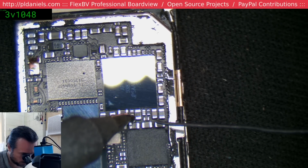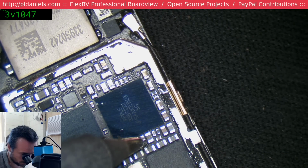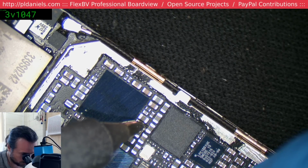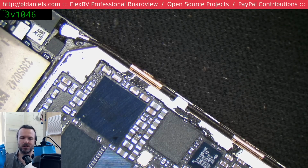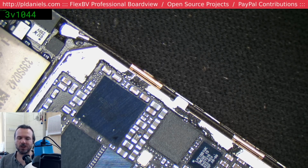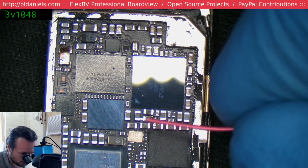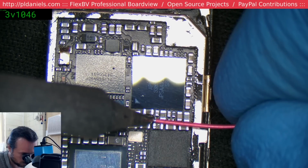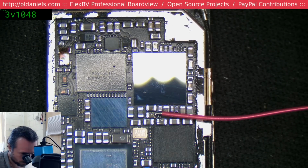So now you're saying there was no backlight on it, and I'm pretty sure what it actually is, the lack of the 5V7 line we have here means that the LCD, with LCDs you have to constantly flip the polarity of the actual driving member. I forget which part of the LCD it is, but you have to basically drive it up and down, positive, negative, positive, negative. Otherwise it will just start fading to black as all the elements get stuck in an overdrive situation. And the 5V7 is one of the lines that is driving that back and forth. And without it, I could be stuffing up on my memory here, but I'm pretty sure.